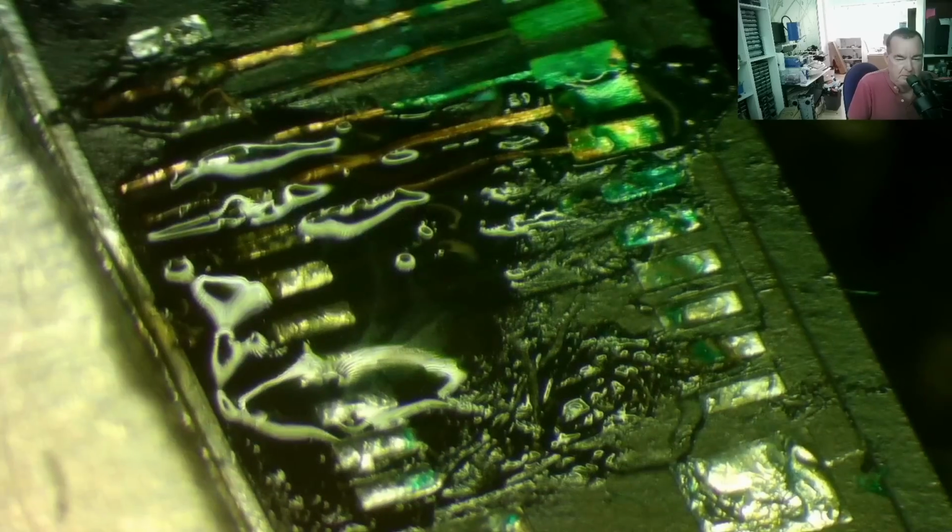Better. The ends picked up a little bit. Let's see. Okay. I'll try not to get any flux onto the solder mask this time. I think that caused part of the problem previously. Well, I think I've got them tagged on. Let's have a look. I mean, they're not exactly flat, but what I'm thinking is now to clean the flux off, put some solder mask further down the whole thing, and then we can see if we can solder them better.